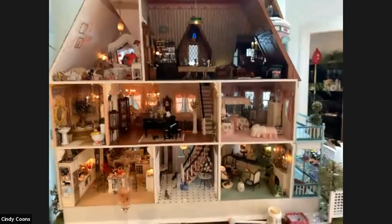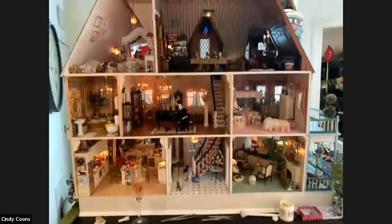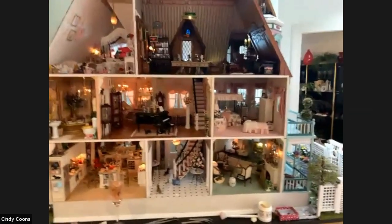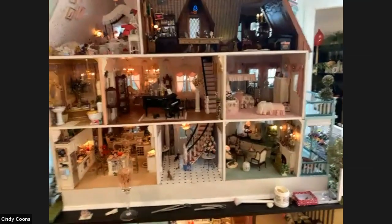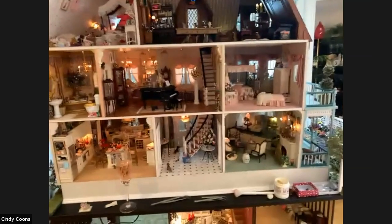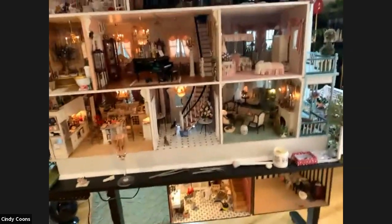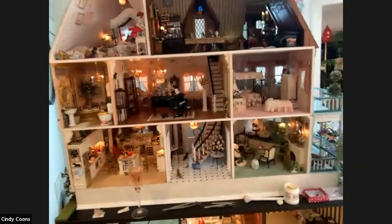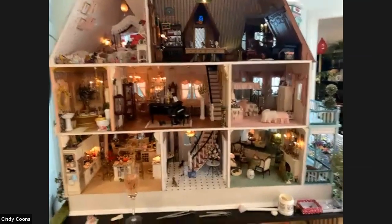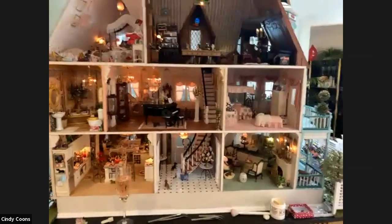If you plan ahead and you know that you're going to want to add things in the future, what are the opportunities? Where do you think you could possibly go with your lighting? Where would you want to possibly add lights? And just consider that. You can always add wiring after the fact on the ceilings, as long as you haven't papered the ceilings or done medallions and things of that nature. Right. You can always add more tape wire on the ceiling and then just cover it up with paint, but that gives you other options.